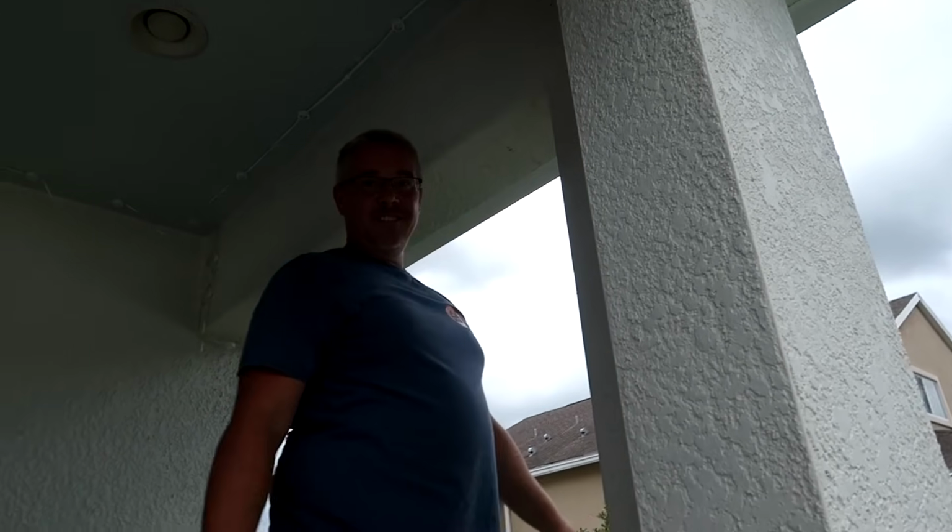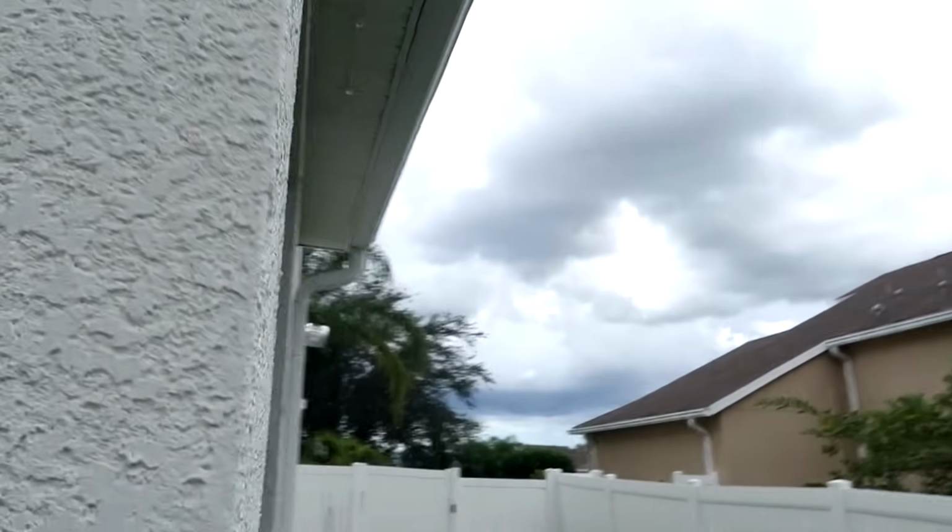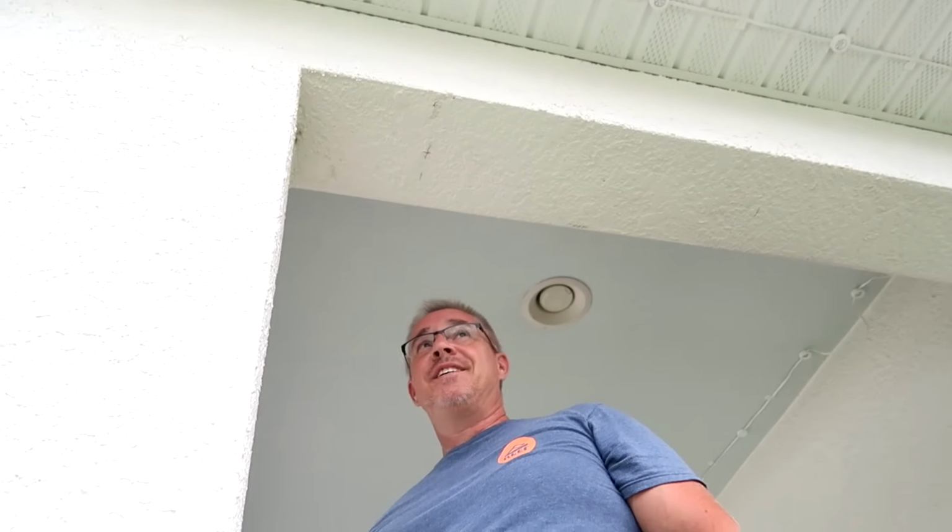Oh my goodness. What's that, babe? Solid stone? The solid stone. I guess no hurricane to push this down. That's awesome. Okay, so different approach there. I think we'll have to use the masonry anchor, like for my signs and stuff, with the epoxy. The Sikaflex. There you go. So we'll drill out a bigger hole. Where are we going to go to get that? Do you think Lowe's even carries Sikaflex? Say it, babe. I hope Lowe's has Sikaflex.